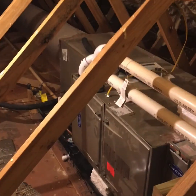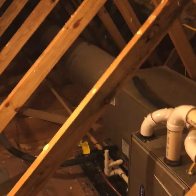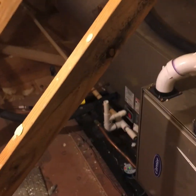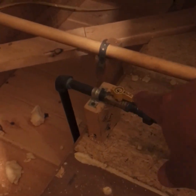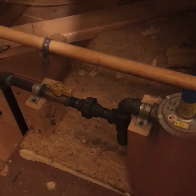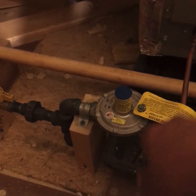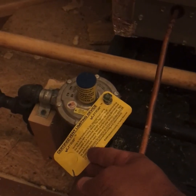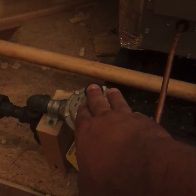This is one of the two air conditioners in this building. We did all of the mechanicals on these buildings — sized out the gas, plumbing, and electrical, laid it all out and installed it. Right here you have your gas line coming up, another forged valve, a disconnect, and a regulator. Here's your little tag that gives the city inspector information confirming this is a code-compliant regulator.